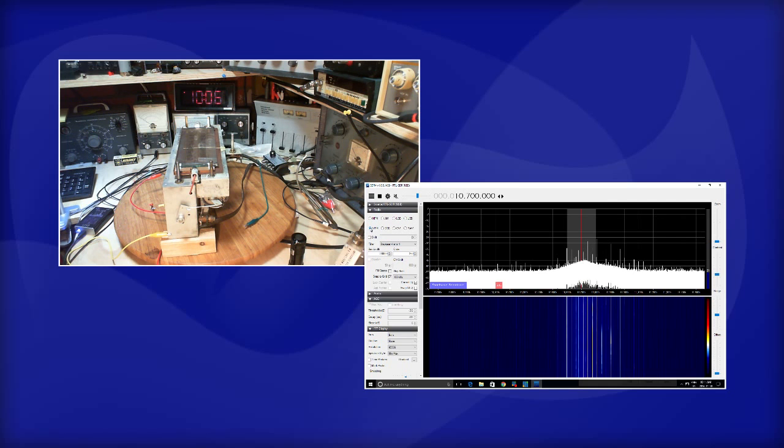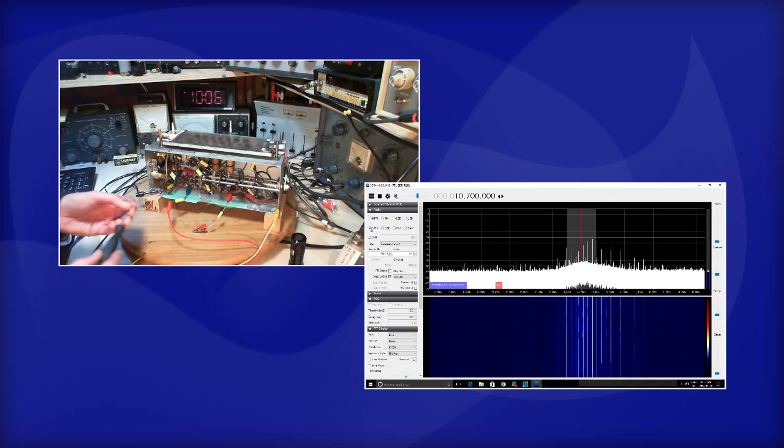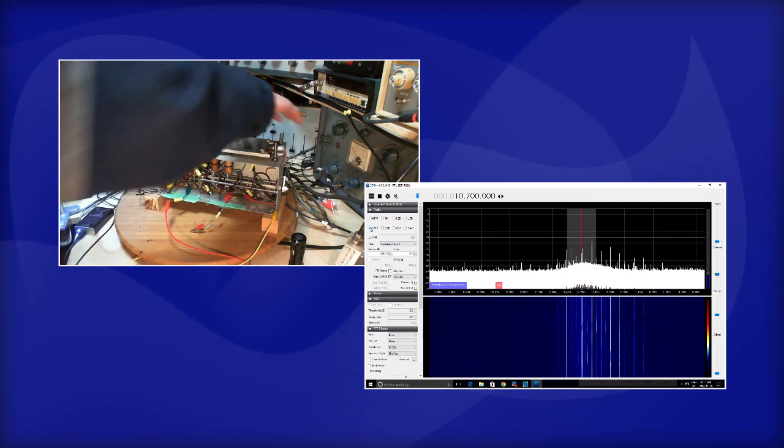Okay, now we're going to start with the bottom coil on the first IF. Get in there. These are painted in place too, which is... Okay, survive that. Well, this doesn't feel like it's painted. Turning now, back the other way. You see something off to the left. Not working with much here, are we? Let me turn down the wobulation a little bit.